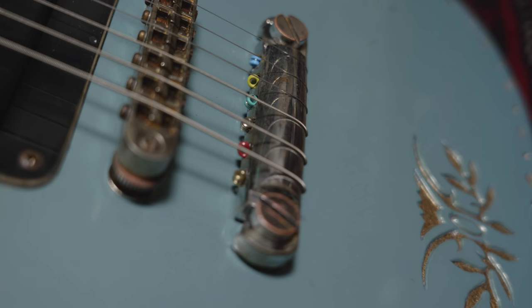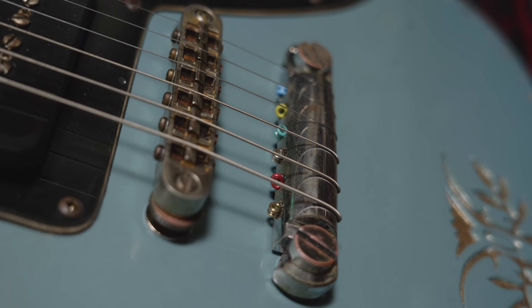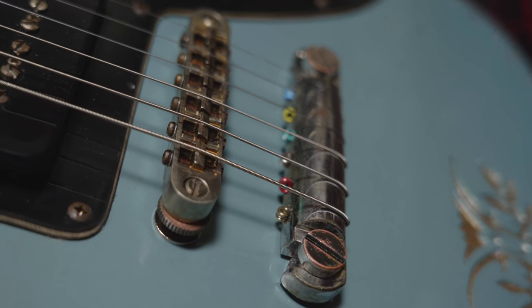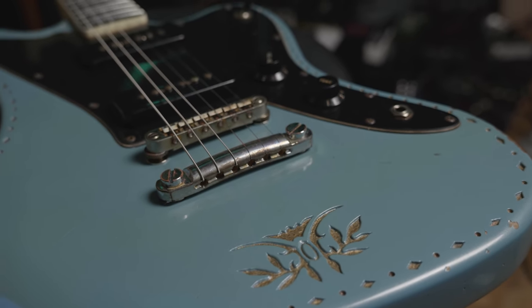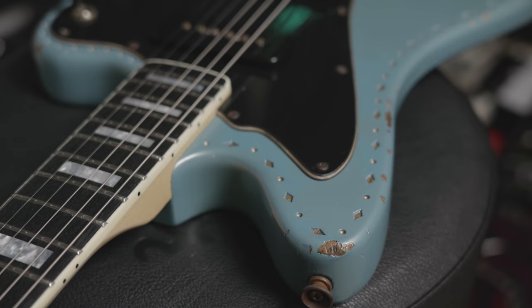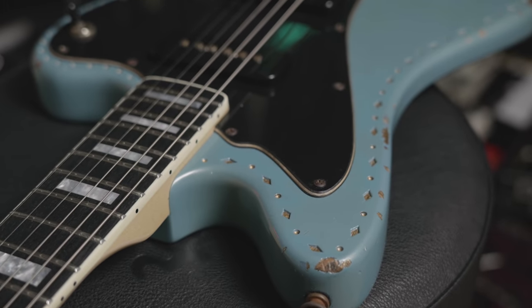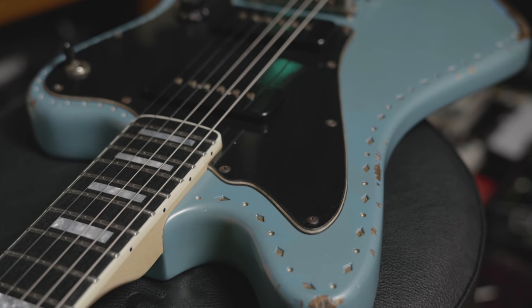Yeah, it's such a nice guitar. I rounded the fretboard edge, but I didn't have to do anything with the frets, which is nice. I just polished them to make them even nicer and slidier, but I didn't have to level them, luckily. So I'm pretty satisfied with the way the DIY kit was, out of the box.